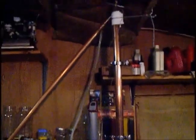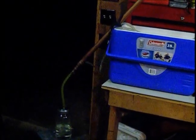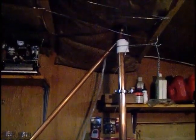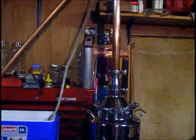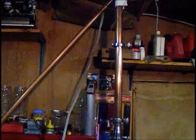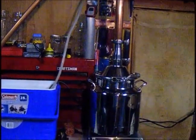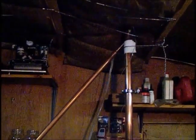The principle behind making white gas is to strip all of the additives and the dyes out of unleaded gasoline. The additives are what clog everything up and cause problems. But once you strip the additives and the dyes out, you've got a real pure white gas. Burns great in Coleman stoves. The stoves I'm testing with are the 425 two-burner, the 502 single burner, and the Russian military 8R. You guys that have dual fuel stoves designed for gasoline would love this, and you're probably not getting it for about $4, $4.50 a gallon. Well, doing it this way you would.